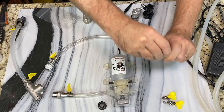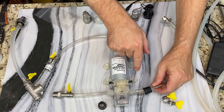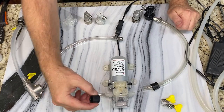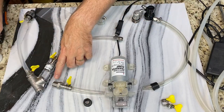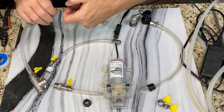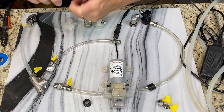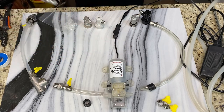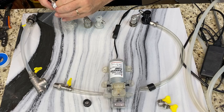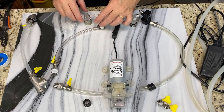After I slide the hose all the way on — it's easier if you get it really hot with some hot water — this cap tightens on and creates a little line so I know it's getting a good hold right there. Same thing over here. For the threaded fittings, you're going to have to put your Teflon tape or plumber's tape — wrap it around, always wrap it in the opposite direction. That way when you go to thread it, you're fine. If you do it the wrong way, it can cause the Teflon tape to bunch or push off, and you don't want that. You want a good seal. And if you take it apart to clean it — which I hope is pretty much every time — you're going to need to take the Teflon tape off so you can get it all clean before putting it back on.